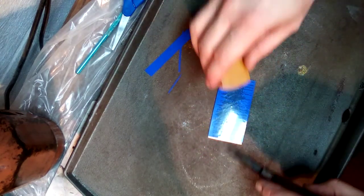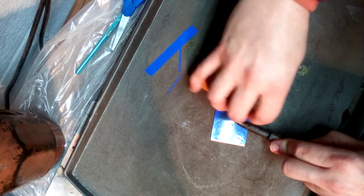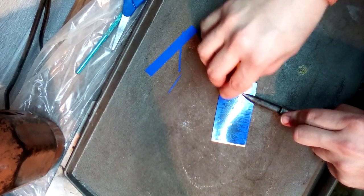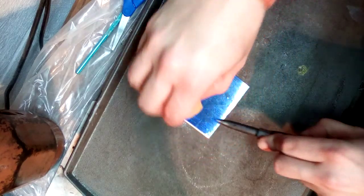At the same time, I'm pushing things down so the paper is in the right place and doesn't slip as I'm burnishing. Once I get the image started, I'm going to bend over and catch the reflection of the light across the surface of the glossy PNP paper to see any inconsistencies that would indicate a bubble underneath. I'm looking across the surface and it actually looks really good.